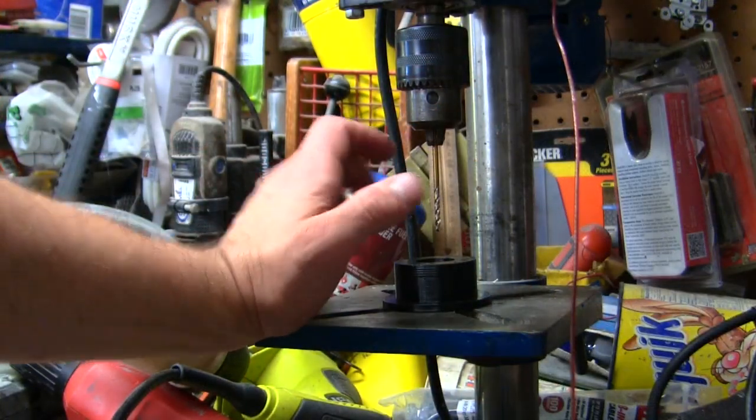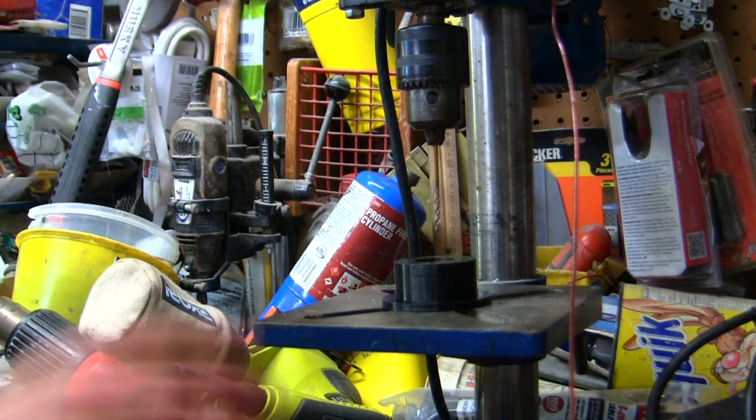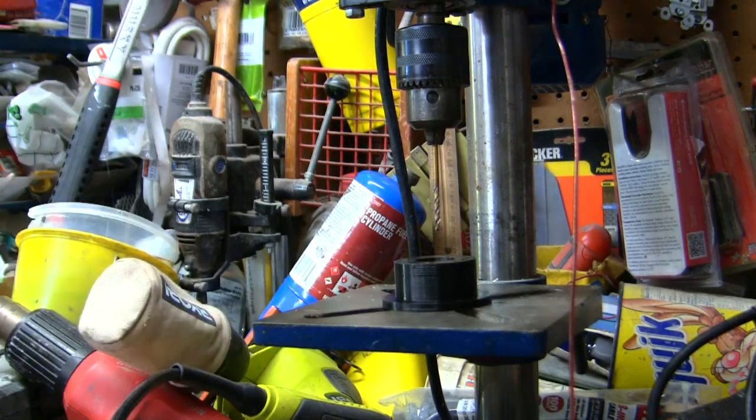Drilling the center holes out is pretty straightforward. Just use a drill press and it puts a nice straight hole directly through. Because the holes are already pre-existing, it's just going to hog out the extra material required without there being a risk of the hole being canted.